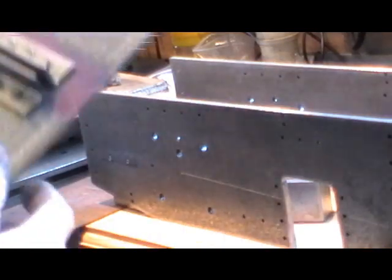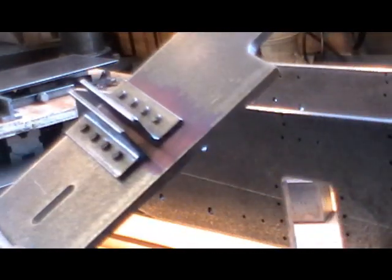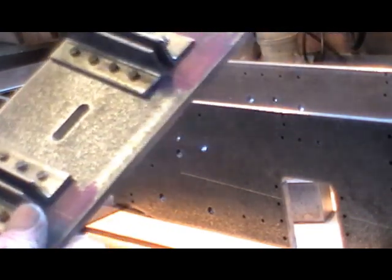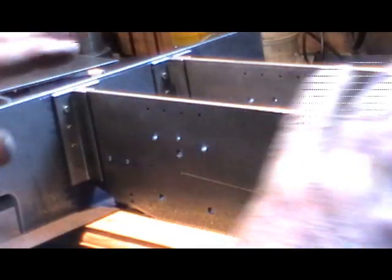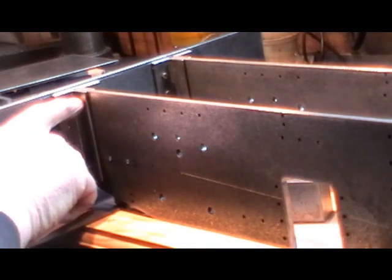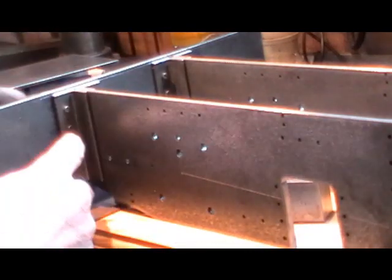What I'm doing is putting one-eighth rivets in these when I finish them off, so there are one-eighth holes in there. I've put 5BA screws in, which are 0.126 inch OD - the same size as rivets - and fastened them up with nuts on the back. Then I'm going to get everything lined up, clamp it all up, and take one angle off at a time so I can transfer from the holes already drilled into the other angle, then drill it and repeat for the other side.